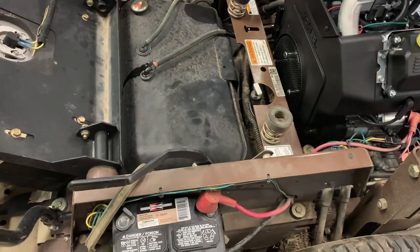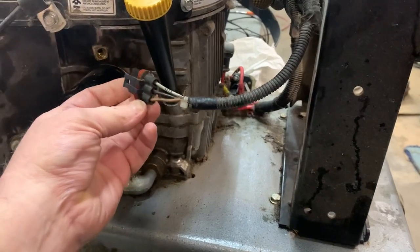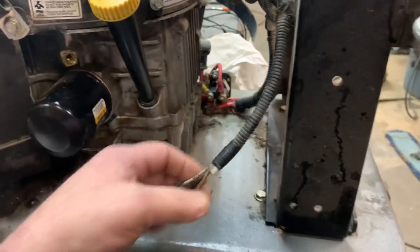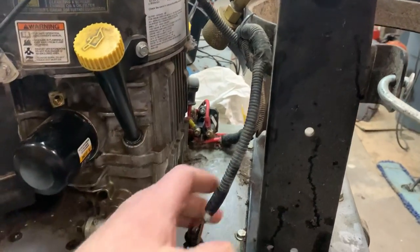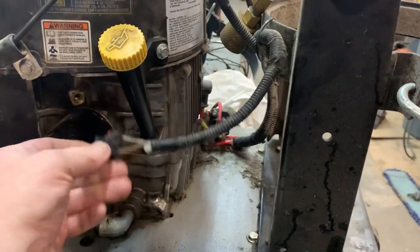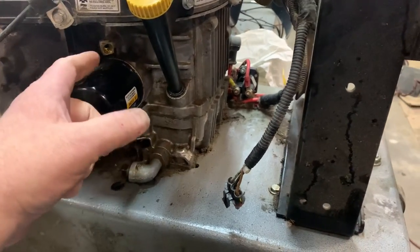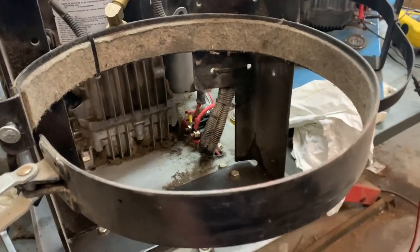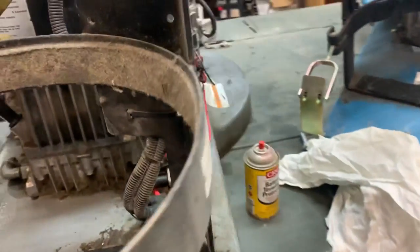A lot of this stuff is just absolute carelessness. You may have seen this buffer in my previous videos — it has the oil switch that was broken. The customer had draped an extension cord over this machine and when he went to pull it, it was looped around this wire. When he pulled the extension cord from 20 feet away it ripped the connector off and cracked the oil switch. Also, a lot of times when they go to put the propane bottle in, they'll throw it in so hard it actually pulls on these wiring harnesses. You've just got to be a little bit more careful.